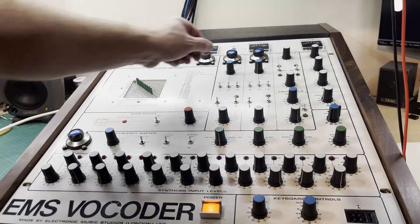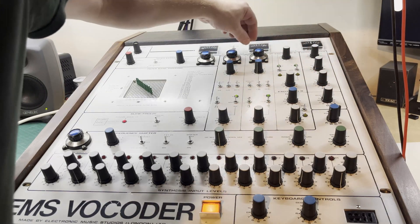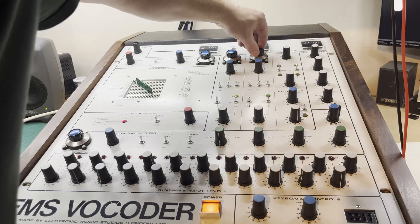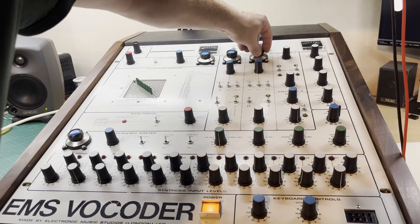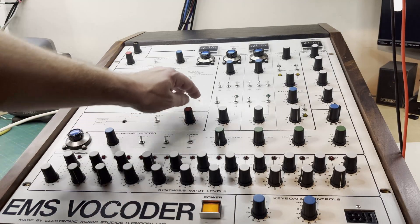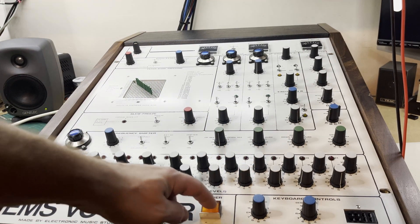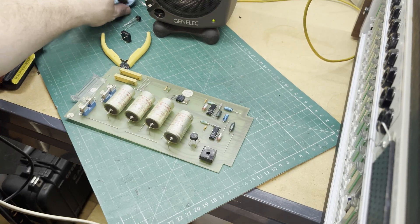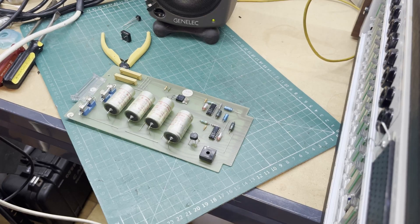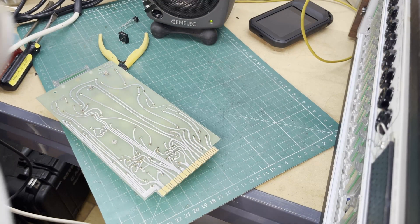I've connected the speaker up. There's some life. It just died. Not a loose connection. Check the boards again. That happened a few times - I would leave it off and when I turned it back on it would just switch off after about a minute. So I'm actually really suspecting this other bridge rectifier. If they were in a batch, there's a good chance this one has gone dodgy as well.